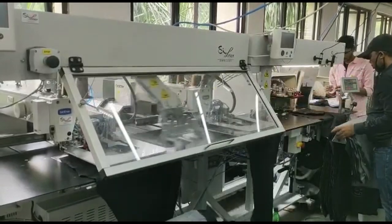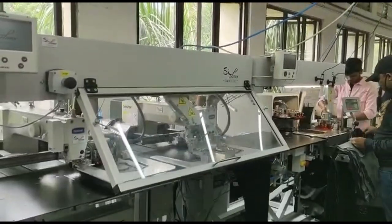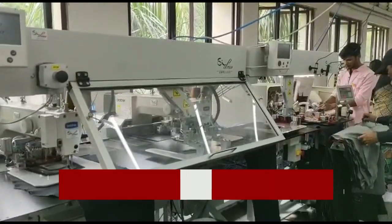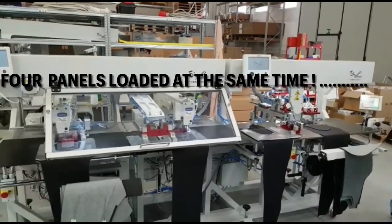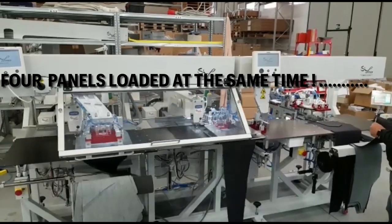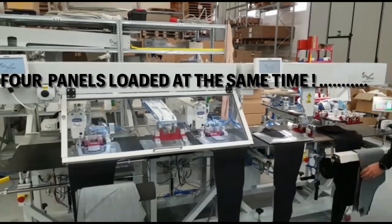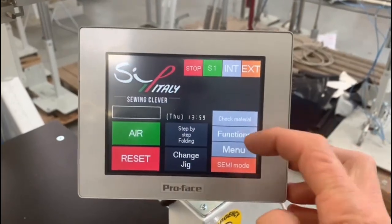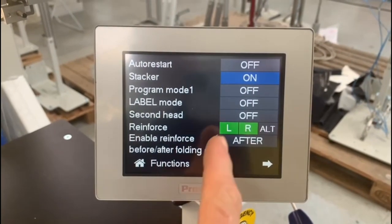The automation is ideal when we feed the sewing head on time. This is the goal for optimal engineering, and the goal achieved by SIP Italy S4SL patented technology. The loader clears the loading position and stops between the loader and the sewing head — the loader is in the middle, always ready with a buffer of the folded pocket and back panel to feed on time. The operator is always in position to load the panel; it is not necessary to wait for the loader movement to prepare the next pocket. A small delay due to fatigue or a missed catch does not affect the sewing start. This is the greatest advantage.